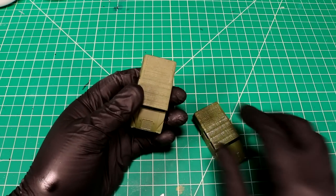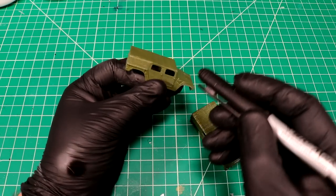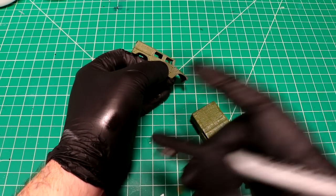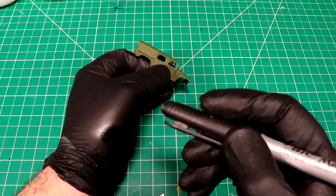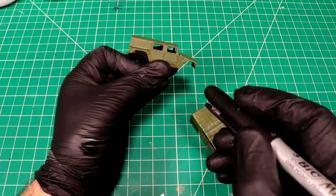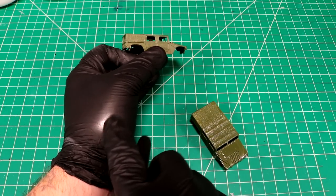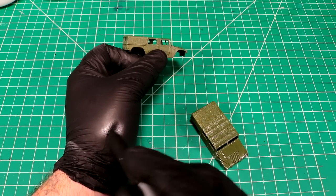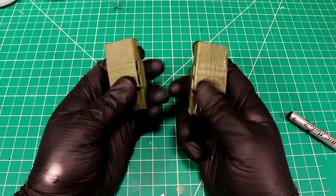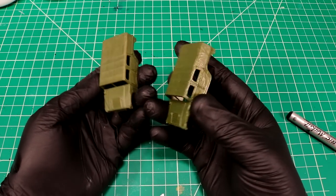I don't know if you guys notice, a lot of times you'll see me finish a coat, and before I go to air dry, you'll see me bring the gun over to my wrist here. What I do is I just spray it on there to see if there's anything coming out of my tip. Sometimes if your tip's getting a little bit clogged, you'll keep getting a little bit of blow by. And if you're trying to dry your piece and you're slowly bleeding out extra clear coat onto there, it's going to be a problem. So that's why I always spray my glove like that. So that's what this is, and this is already dry. I mean, I just came out of the spray booth. These are totally, completely dry. So, hell yeah, man. That's a pretty good product.